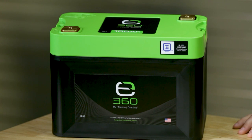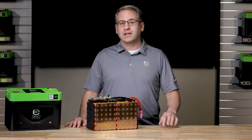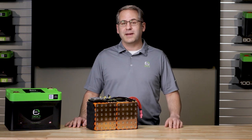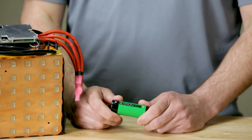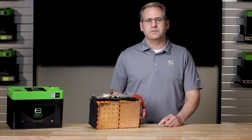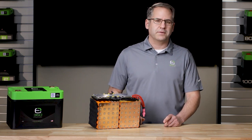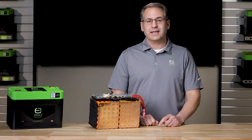In its completed form, the Xbeyond 360 battery is 50% lighter than the competition's equivalent lead-acid battery. The individual lithium iron phosphate cells are of the highest quality and proven efficiency. The standard 26650 cell is rated at 3.2 volts DC and 3,400 milliamps, but they also have a 3.2V DC and 4,000 milliamp version for their high-density XDP line.